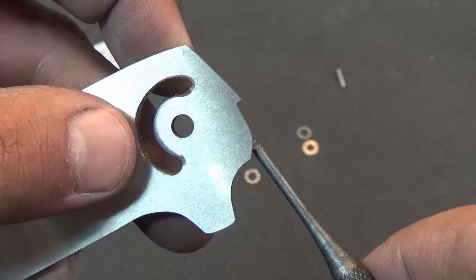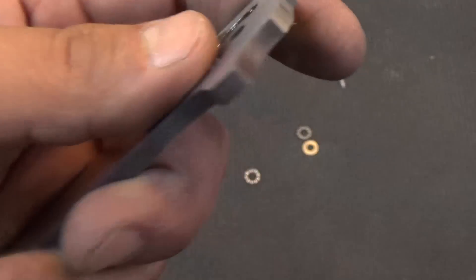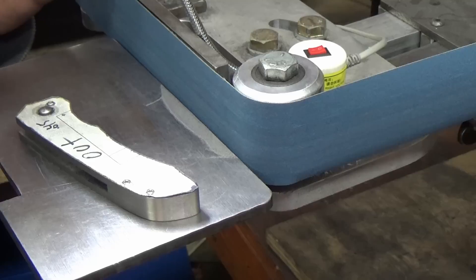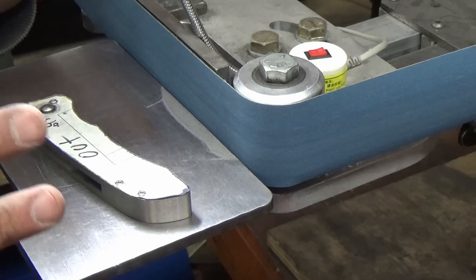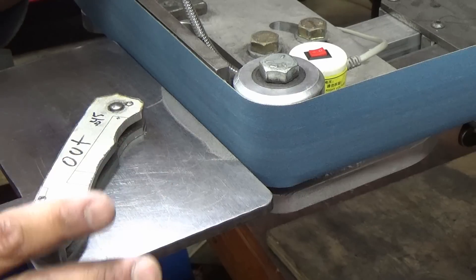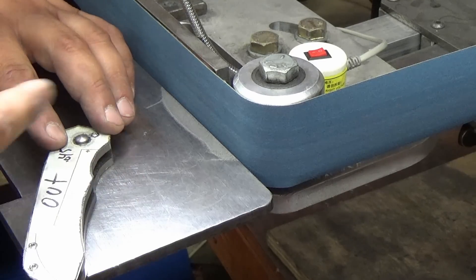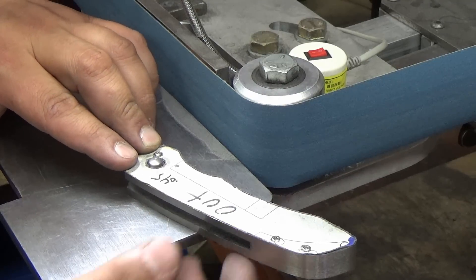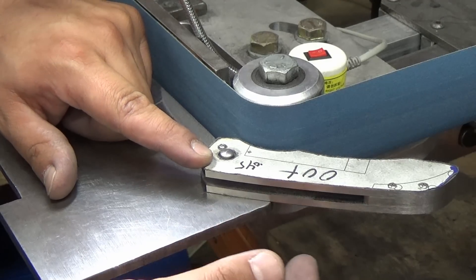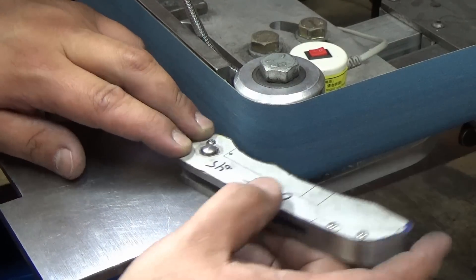You can see how we cut into the lock face — but that's okay because our lock face is going to come back to here. Hopefully we didn't go a little too crazy. Check your design before you do what I did. I didn't take apart my work rest setup — you don't want to change anything until you get everything done. Because even if you go to set this back up, there are chances that you could have set it up just a little bit wrong. So before you break down your setup, we're going to go in and get this done here. I still have a little bit where I can hold on — I'm hanging 75% off the platen, but I can just kind of rock it in like this and get that finger choil cleaned up.